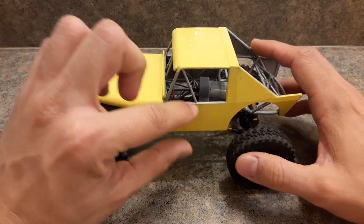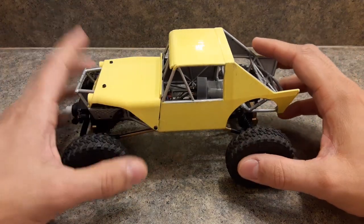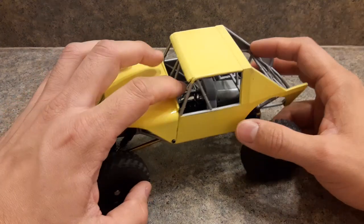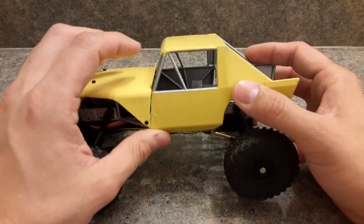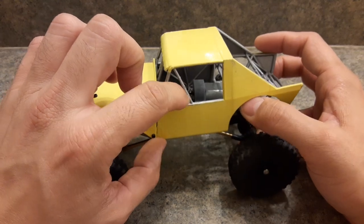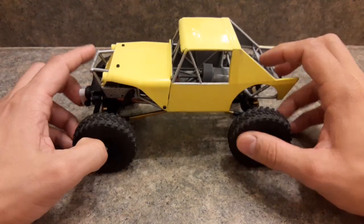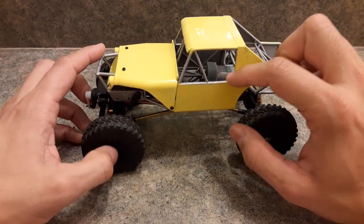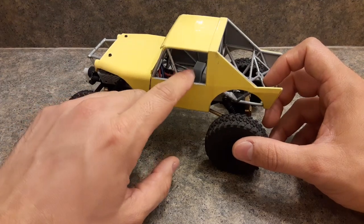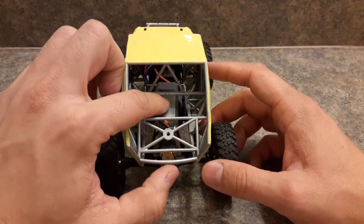From the pictures shown before, you can tell you could put the original motor facing forward, which brings the weight forward, and then the battery goes in the front. For this one I went ahead and put the 180 motor in there. This is one of the motor plates that I printed myself with the resin — that's why it's a little bit tilted back. I didn't cure it so it's kind of soft still. What you get when you order the motor plates from Shapeways is actually really nice and stiff.